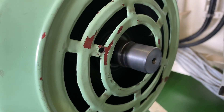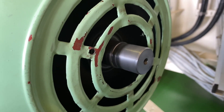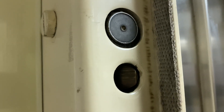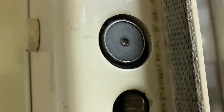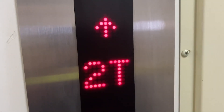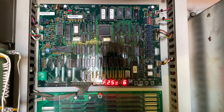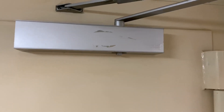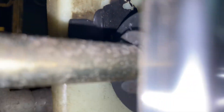After checking that side, I moved on to all the interlock systems. I found that the interlock limit switch on the third twin deck in the engine room was giving an intermittent signal — a little air pressure was causing the door to open by itself. If this happens during operation, the elevator stops and gives an abnormal alarm. I adjusted all the hinges to prevent this from happening again and corrected the limit switch on the third twin deck to give a correct open and close contact.